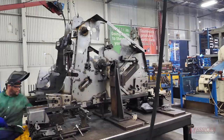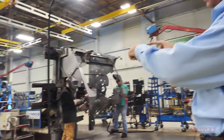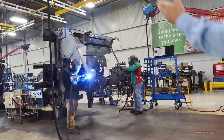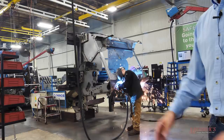Like the tailgate, the left and right side sheets go on an initial fixture where they are married — cross tubes are welded together to make a pre-assembly. Then it's transferred over to a manipulator that can move it around for finish-out welding. The manipulator can twist and turn the whole machine to any position, so welders can stand and work at the right angle rather than sitting or bending. It's a ground-based piece of equipment, not hanging from the ceiling.